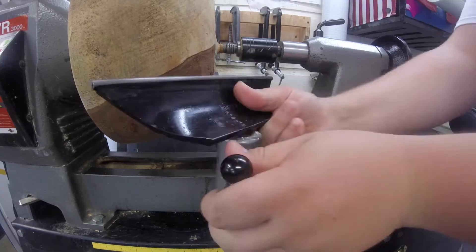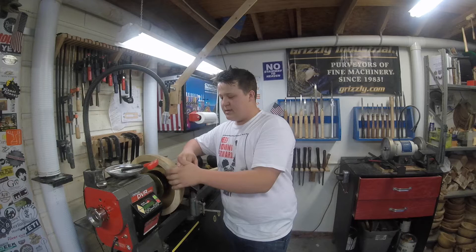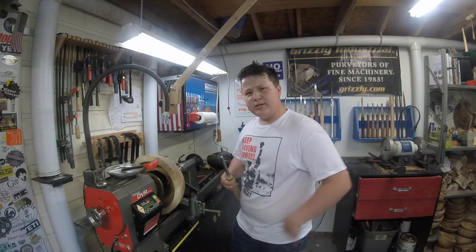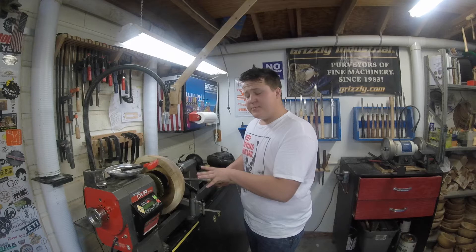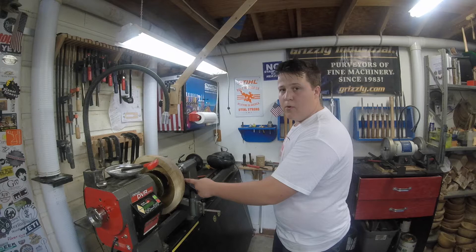I've never been one to get worried about the more complicated nitty-gritty aspects of woodturning, like setting your tool rest height perfectly. Here's what you're gonna do: I shoot for about center on almost all the tools I use. This doesn't necessarily apply to carbide cutters, but I use high-speed steel, and with high-speed steel it doesn't really matter where your tool rest is. The only thing that's gonna come into play is your bevel — if I'm a little above or below center I can just move my tool handle up or down to engage the bevel more or less, and I'll get the same cut either way.